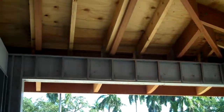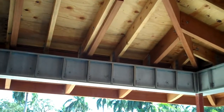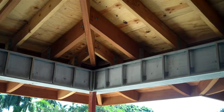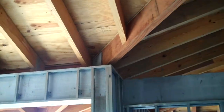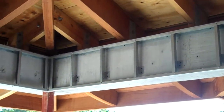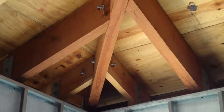What I want to show here is the way this structure has been reinforced. This is on a new construction custom house on the waterfront of Miami Beach. You can see the heavy plates for the roof-to-wall connection on every joist, and also the way the wood is being bolted together.